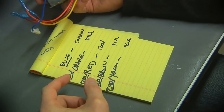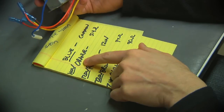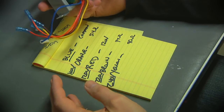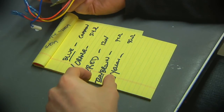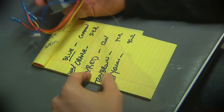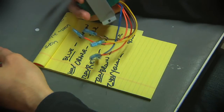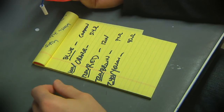So if I rewire this thing a bit, let's say someplace between where the blue wire goes into this transformer and the first winding, the orange one, it's broken for whatever reason. Who knows? Maybe it got fried. Maybe it mechanically broke. Who knows? But my theory is that since I'm only going to ever use this thing here in North America, what I can do is repurpose it a bit and use the red and the yellow and basically have the same ratio on the input. But I can pull the yellow and I can actually just reroute this onto the main board, and that might give me the voltage output that I need. It seems logical to me. It's measuring reasonably across there, so I guess it's worth a shot, and we'll see if it blows up or not.